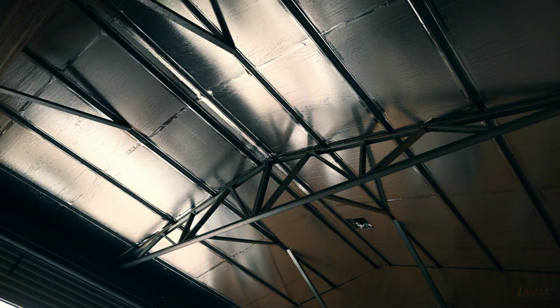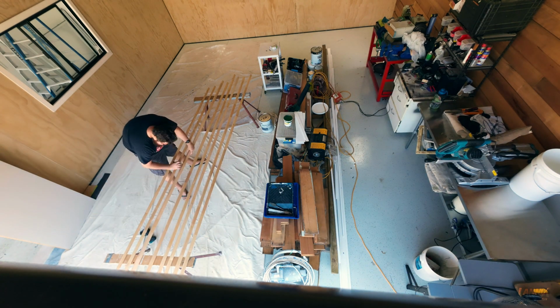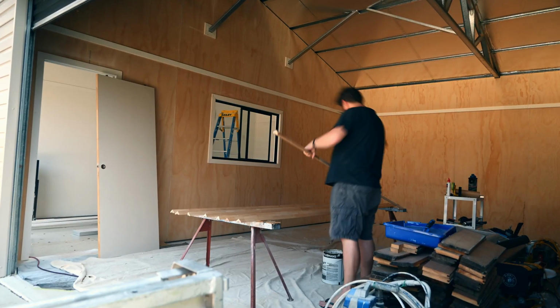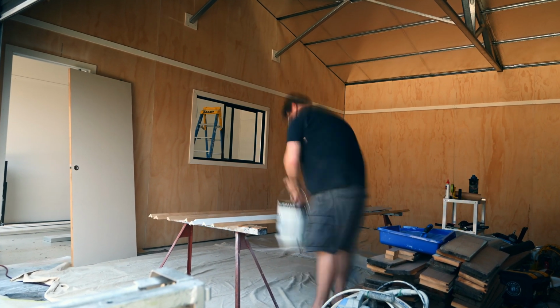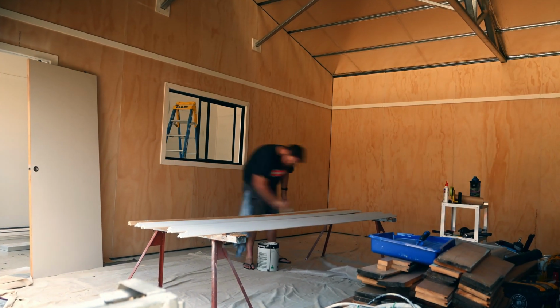First, I took down all the trim from the ceiling. Why, you're probably asking. Well, I plan to leave the foil insulation sheets unpainted and coat the trim pieces black. Keeping the paint off the foil while cutting in the black paint while the trim is up on the ceiling would be ultra tedious. To me, this seemed like the least painful way to get the finish I wanted.